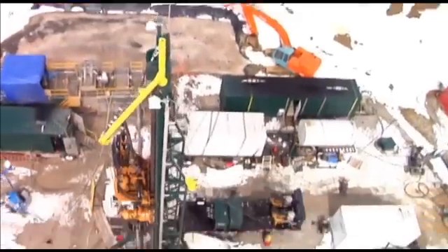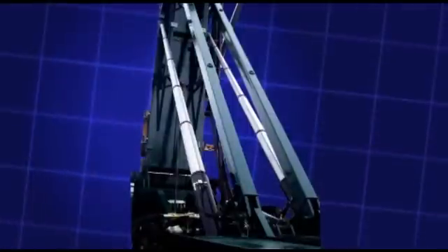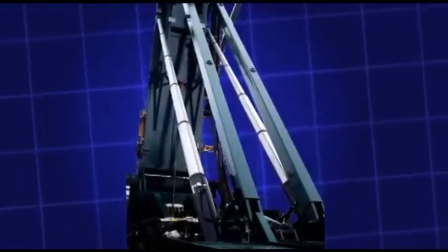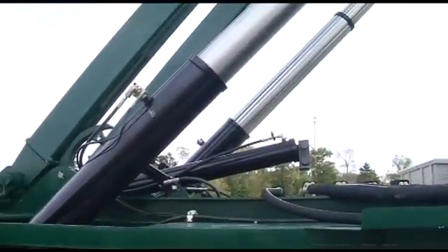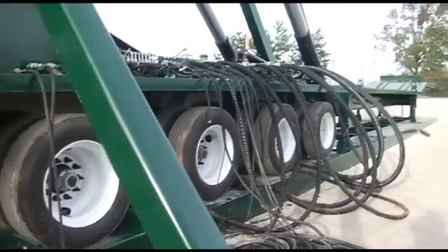The 77-foot state-of-the-art drill rig features dual hydraulic, four-stage telescoping lift cylinders, rear-mounted for drill rig lift and stabilization. Dual struts are fixed between the rear of the drill derrick and the drill rig trailer for backside safety support.